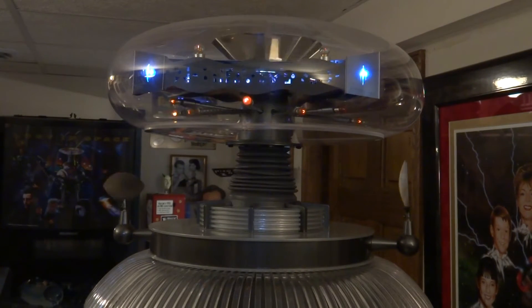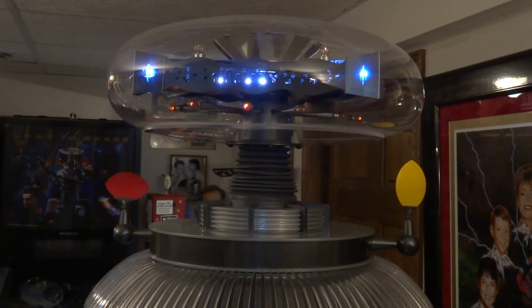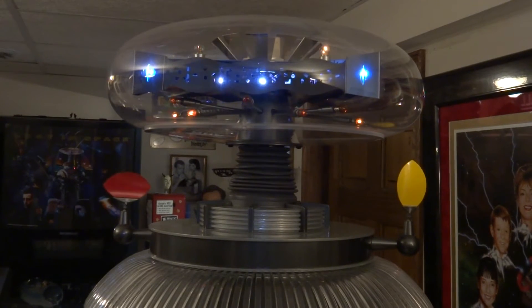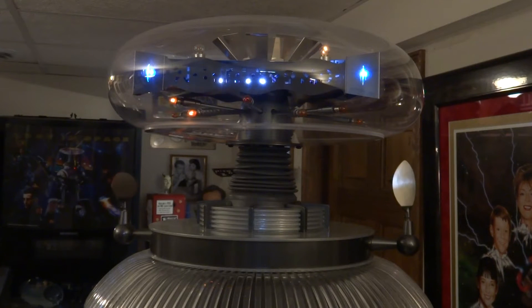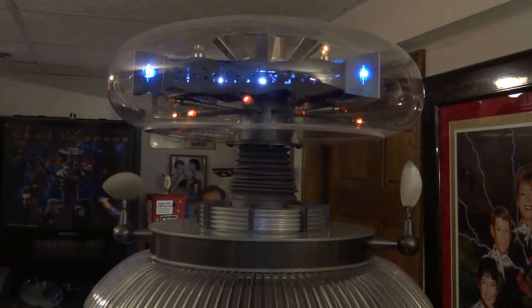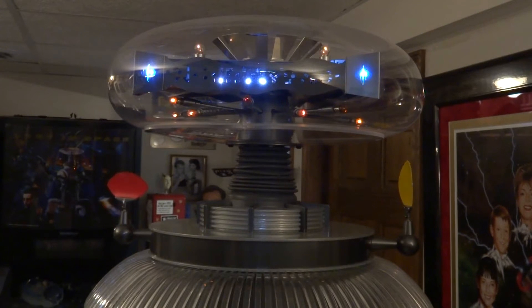You can cut the voltage, but then that'll slow the motor down, reduce the sound, but you'll also be robbing the motor of some needed power. So why don't we just reduce the duty cycle. Let me bring up the ear motors all the way, then I'll bring it down about halfway to 50%. You've still got pretty good speed, but the noise really reduced. I'm going to play with the PWM a little bit. That's like 20%, and they're really crawling — but they're quiet.